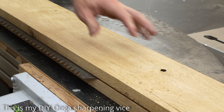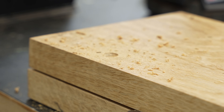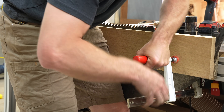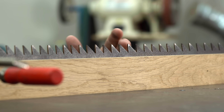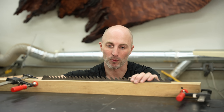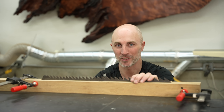Normally if you do a lot of hand saw sharpening, you use a specialized device to support the blade. I don't do a lot of hand saw sharpening, and this is a really weird-shaped blade, so I jointed a couple pieces of white oak, screwed them together, and just clamped all of that to my workbench. I've never sharpened a hand saw before, so I did what anybody should do — watched one YouTube video and now I think I can pretty much call myself an expert. The steps as I understand them: flatten all the teeth to the same height, come back and flatten each edge, making every tooth like a little chisel.